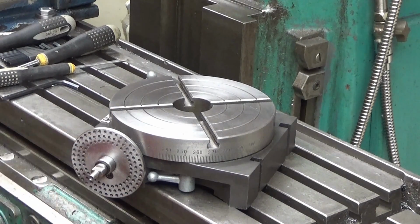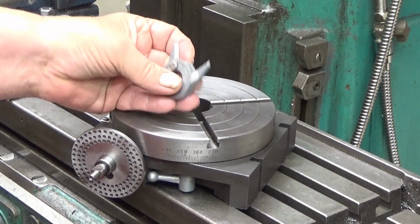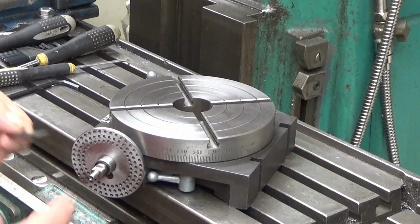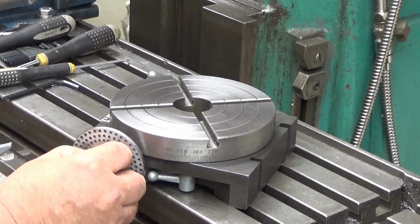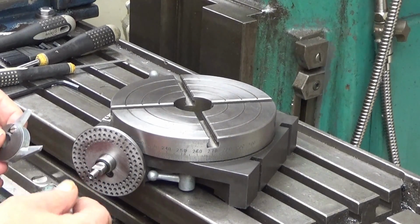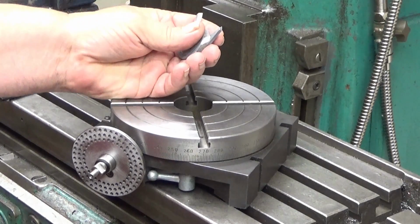So now, then we had these so-called sector arms, which are used when you do divisions. These are not absolutely necessary, but they are a very good aid in remembering things. The intention was somehow to have something here that pushed it against this plate and made it so that it wouldn't turn while you're turning. But what happened was that it was actually turning. When you turned the crank, the sector arms followed your crank. That's not what you want to happen. You want them to stay in place. So I was thinking what to do about this.